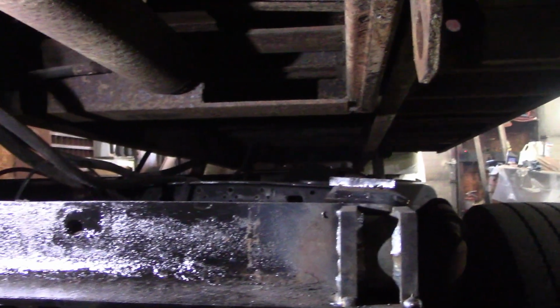All right, so I got my hinges made. As I show you a picture of that, you can see how I put all that together. But it turned out pretty decent. We're gonna set the bed down now. We're gonna put a washer. I left enough room for a washer in between here and this face, so the washer can turn independently so this isn't wearing into this, because I imagine he's gonna use the crap out of this bed. So, okay, let's set her down.